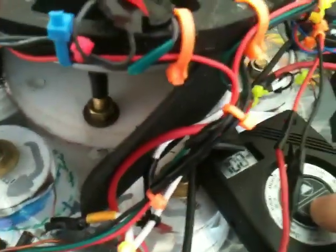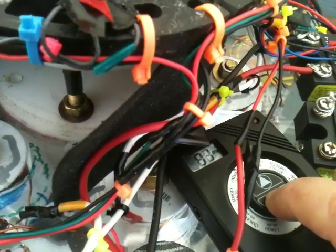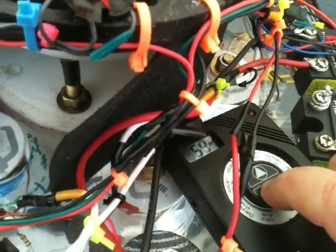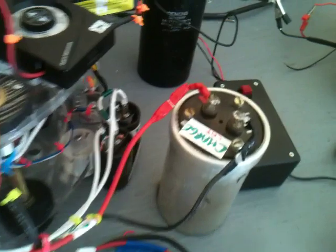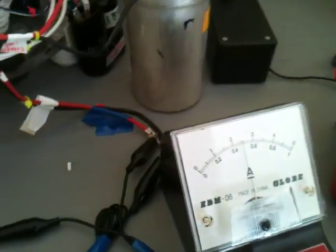We're at 100, and we're going to increase the pulse width modulation — you'll hear it speeding up because we're now increasing the voltage going into our discharge cap. This is the blue circuit, this is the green circuit, and this is the yellow circuit up there. Correspondingly, we have a two-ohm load on the yellow circuit and the same load on the blue circuit. You can see we've now reduced our draw.